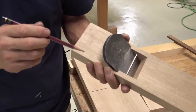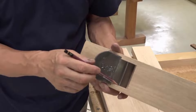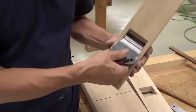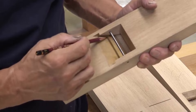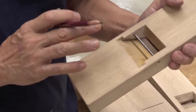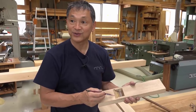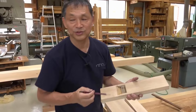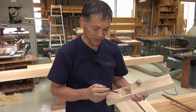No matter how hard the wood is to work with — whether it's hard or burly — if you do all of this, and so long as the plane has a small mouth opening, that's why this part of the blade slot is so important. Drawing an arc like this, this area should fit firmly against the blade. It's not a matter of making the entire surface touch the blade — this area here needs some space. If this area were also to fit firm, there'd be more chance the blade's tip would move around. There should be a gap of approximately 20 microns — a hair is about 40 microns — so that should be fine. You must consider which areas need to be in contact and which areas require gaps.